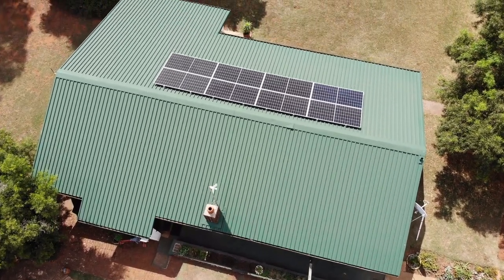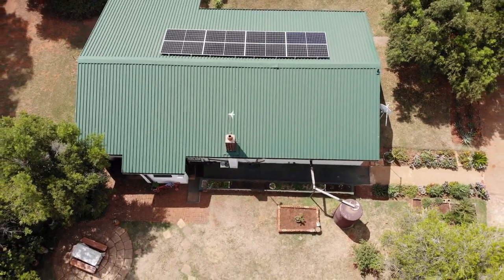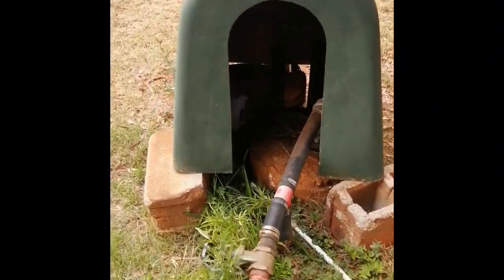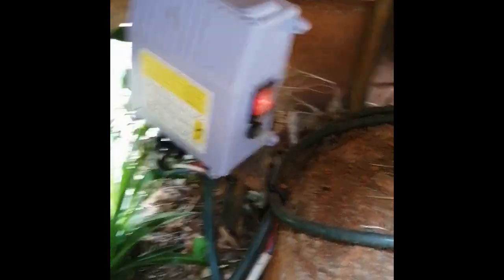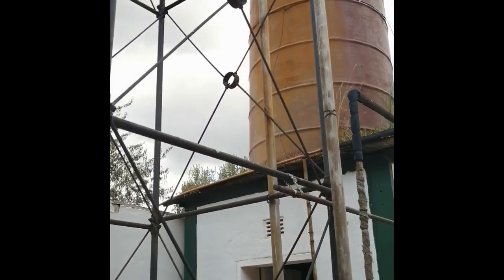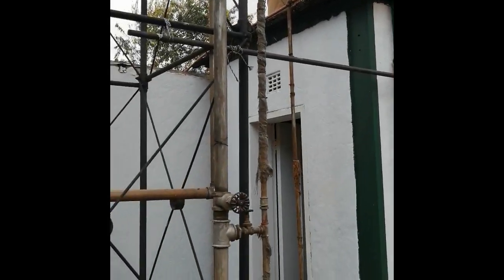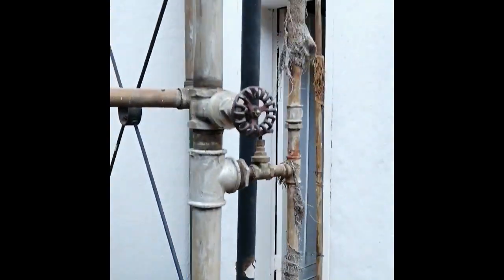A couple of our neighbors make trailers, so they need substantial three-phase power for pumps and equipment. Our water pump was also a three-phase pump. So one of the things we had to do at the same time as the solar installation was replace our borehole pump — which was good because the one we had was 1970s technology and was just about to calcify over when they pulled the pipes out. We put in a submersible pump, which is now powered by the solar panels and battery. We couldn't have used our old three-phase pump with the solar system because there's a big difference between three-phase and single-phase power.